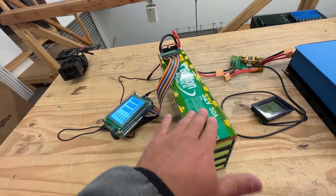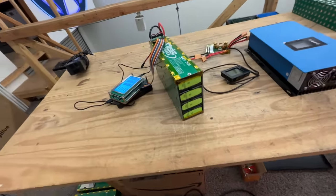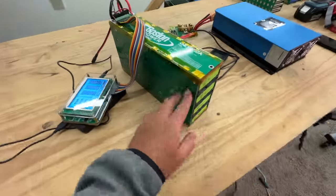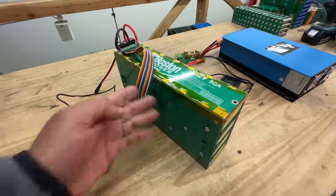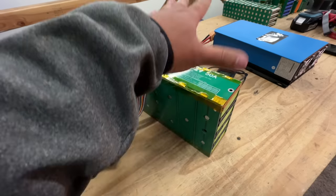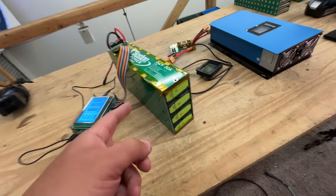A few people were asking: what about for an e-bike or something smaller, like a 48-volt at one kilowatt? So I thought, can we make that? We could just flip the batteries around — they come in these little modules — and you could do 14S in that same space. This module is exactly the same size as the 24-volt but configured in 14S.